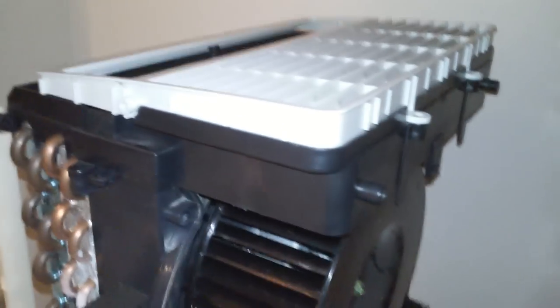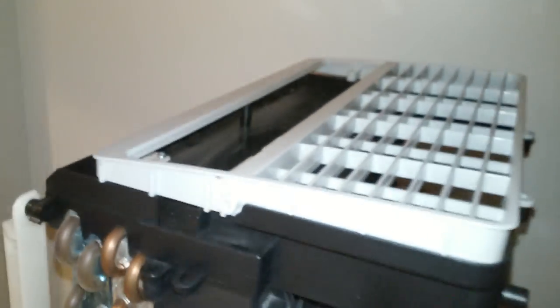What this allows the system to do is to charge up the capacitor and get the fan running. It allows you to de-ice the fan because now your freeze protection is no longer functional. All I've got to do to fire this baby up is plug it in. The fan is running, and now all I have to do to turn the compressor on is flick my switch. It sounds nice and quiet, it's running great, it's got a good solid connection. This dehumidifier is back in action.